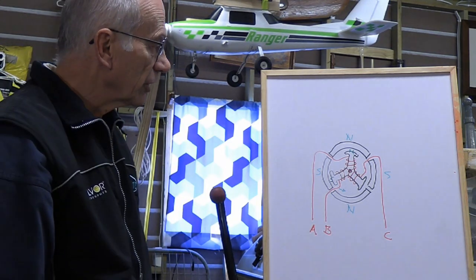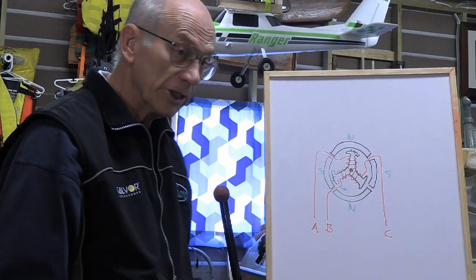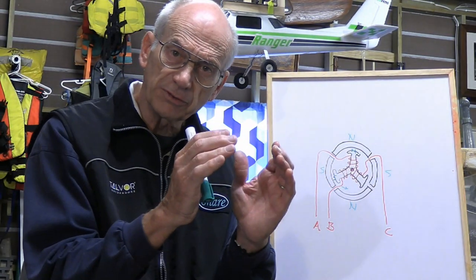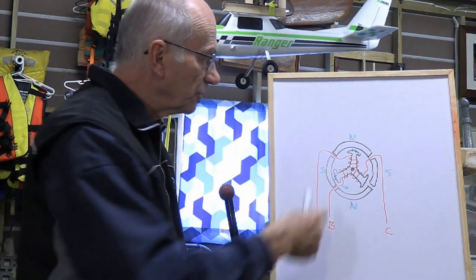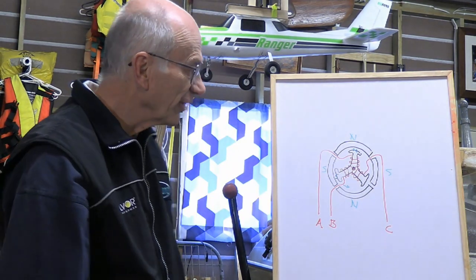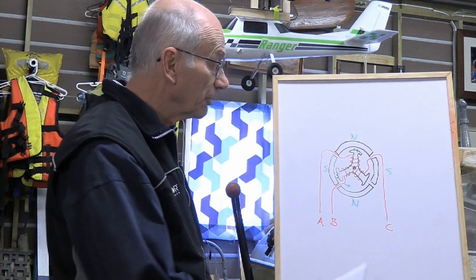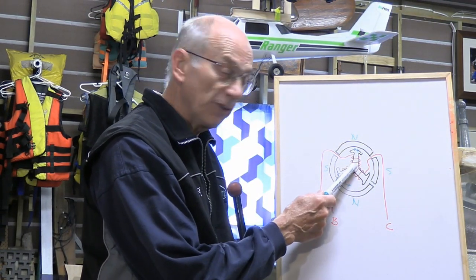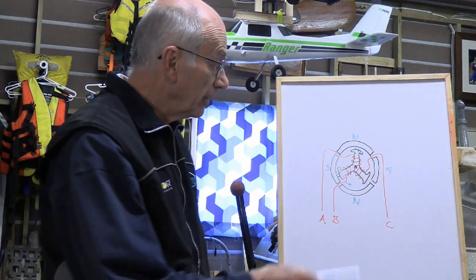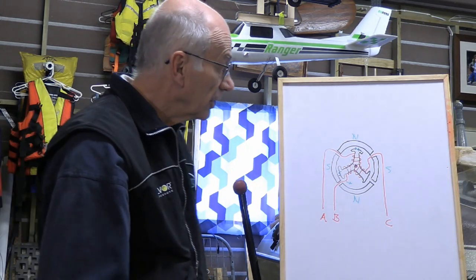That's the nature of a brushless synchronous DC motor. With a brushed motor, little contact surfaces on the center shaft use brushes to decide which part of the motor gets current — but these motors run at around 50 amps, and brushes in that situation are going to burn out and wear. But if the windings are fixed and don't rotate, with wires just dodging the rotating parts, the permanent magnet part can spin without any wires connected to it. That gives you a brushless motor.